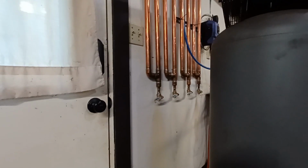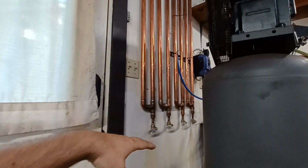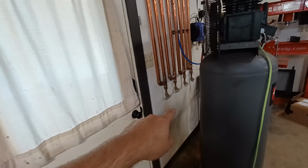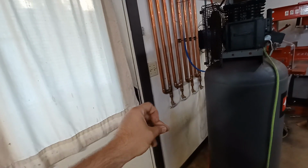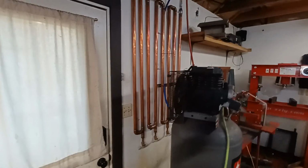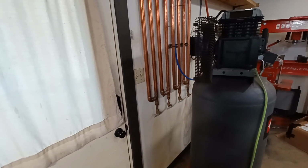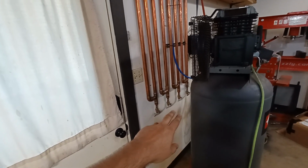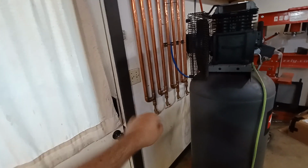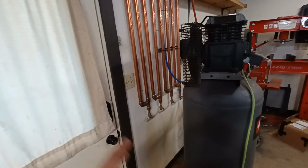If you can get a really high velocity, violent discharge, that is going to be more likely to rip the moisture off and flush out the system. That's one advantage that those electric valves would have, is when they open those solenoids, it may release even faster than what I did. So I do like that idea of combining all 4 into one single, but just make sure it's very large and high volume, high flow, because if you neck them all down, you may not get that big burst of exhausting air.